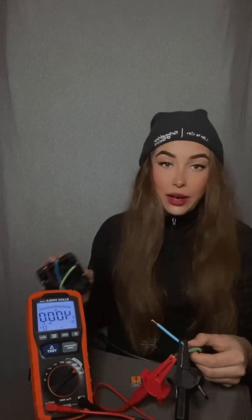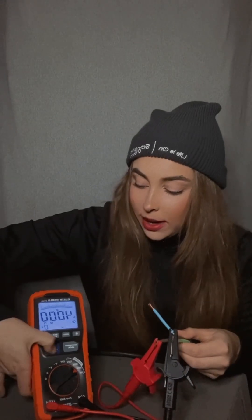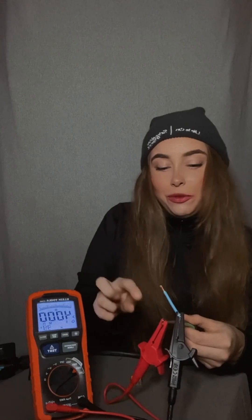We're going to test this cable and circuit to see if it's okay, to see if there's damage or water damage. I've put the testers between live and earth — click test — good. I would then repeat that test with live and neutral, and earth and neutral, and then it should all check out fine.